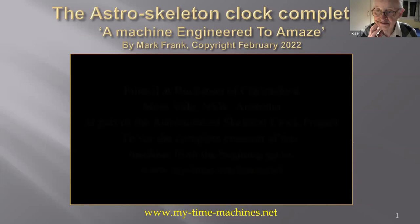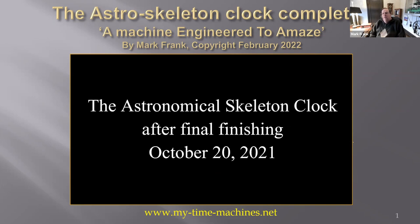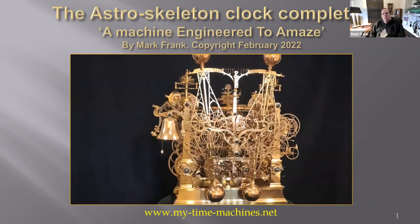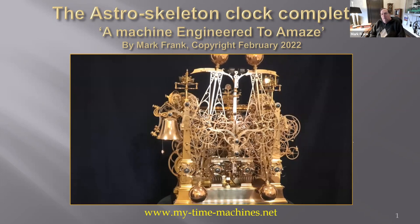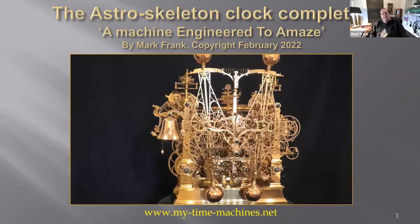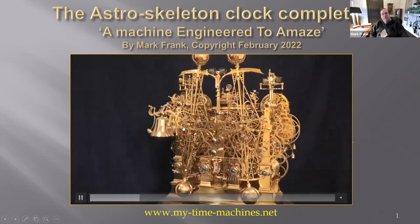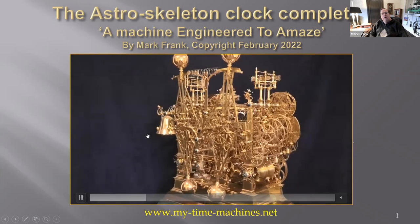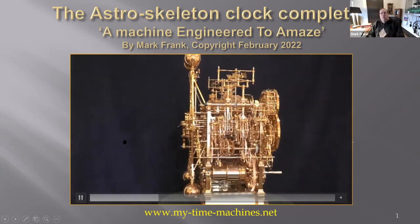The key thing here as far as servicing is that number one, except for very, very few easily accessible areas, it is a dry runner. And oil is the primary reason why clocks fail. So we don't have that issue because ceramic bearings do not require oil. The design that we used for these anti-friction wheels back here for the pendulums also allow us to not have to use oil. And of course, Harrison's escapement does not use oil.